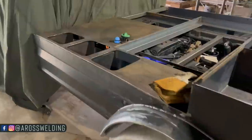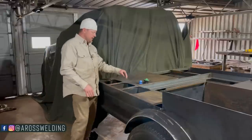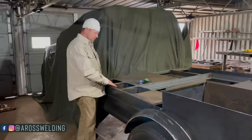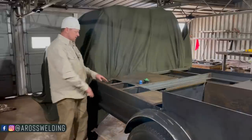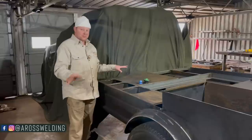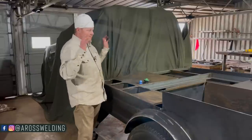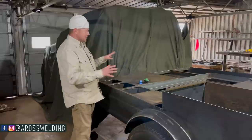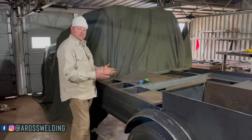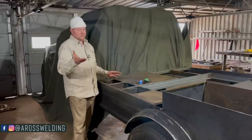Other than that, once I got all the holes cut out, I took a sanding pad and a grinding rock and cleaned them all up nice and smooth, and angled the edges. That way, whenever the welding leads come out, they don't scrape the coating off the leads. Super satisfying. That's gonna be it for this video. The final reveal of this welding bed will include a locking lid, because the customer wanted locking lead wells — which is a very good idea when you're traveling as a pipeline welder.